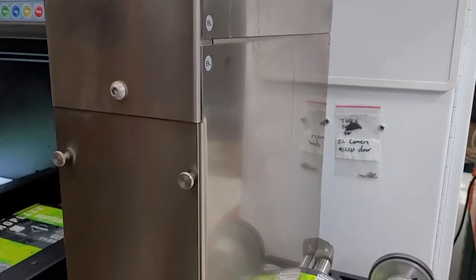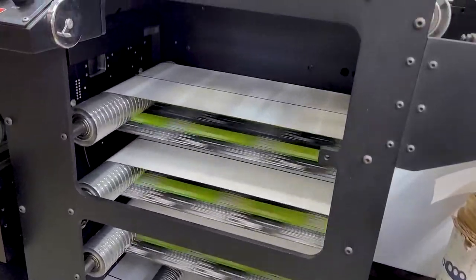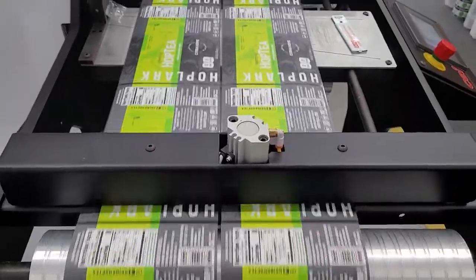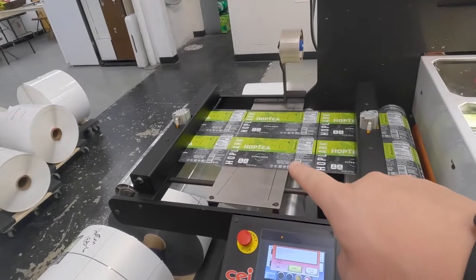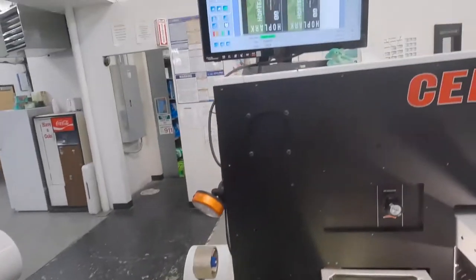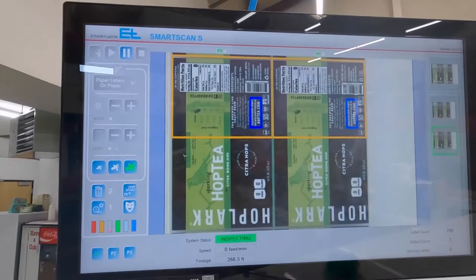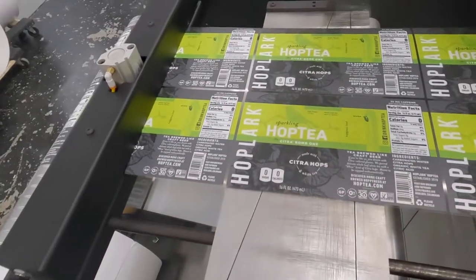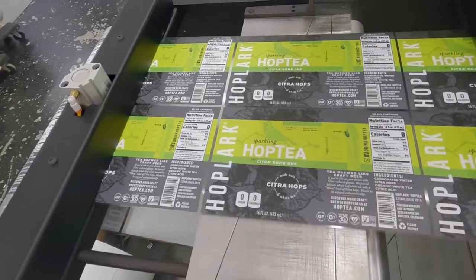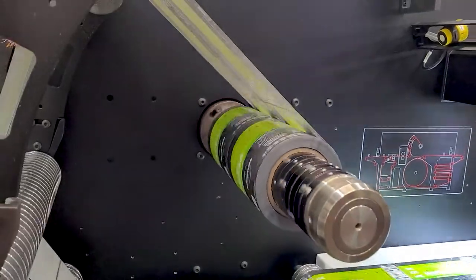It brings the web all the way up through the table — it goes through the camera here, through all the winders, slows down as it comes up, and stops it right here for our operators to inspect the labels and do a QC pass. It gives us a warning on the screen of what that looks like and where we should be looking. When we see a label that's bad or needs to be taken out, we come down here to this splice table, cut out the bad stuff, pull it all through, and splice it back together so you won't even see a seam on the other end. You get labels that are perfect coming off this roll.